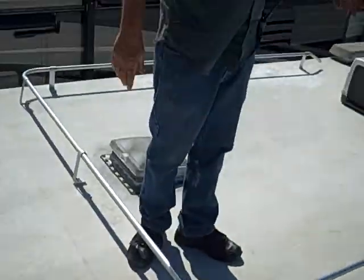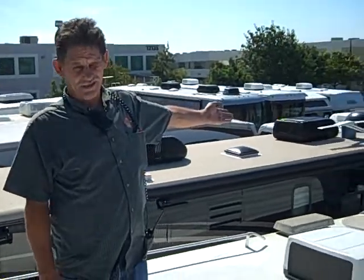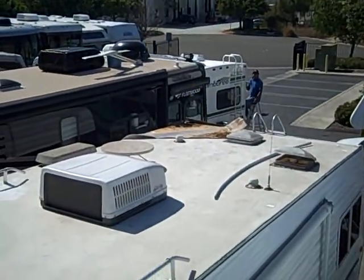So once again, before you allow your roof to get like that, make sure that you look at the roof once every 6 months. Most likely it's going to need some kind of a touch-up once a year. If you'll do that, it'll cost you $8 or $9 for a couple of tubes of sealer, your time, versus $4,000 and my master certified tech's time to rebuild your roof.